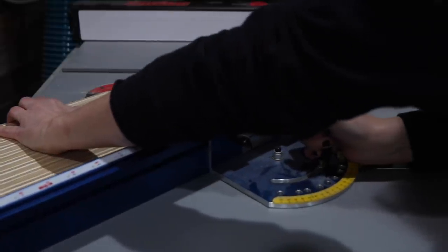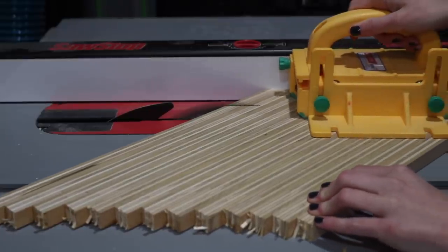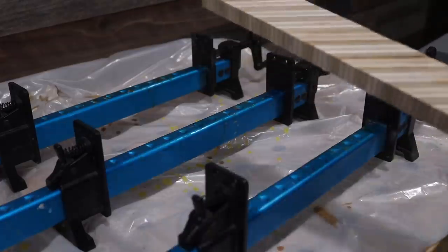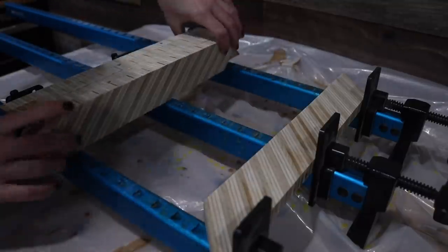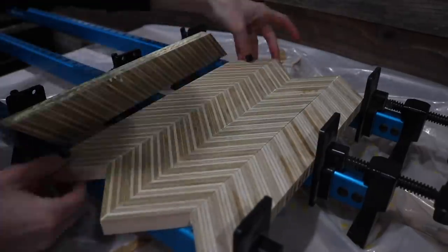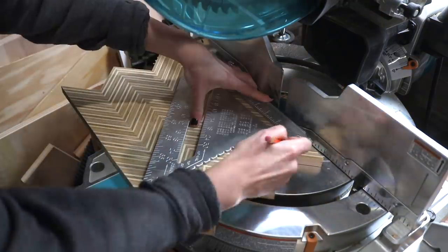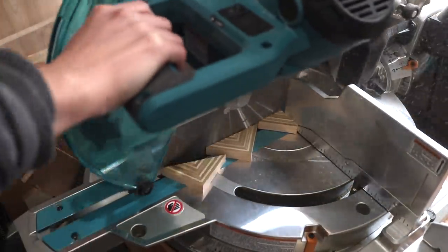Something I did differently the second time was that I decided I wanted my diamond patterns to be larger, so I cut all of my strips at two inch increments instead of one inch increments. I also made sure to keep them in order from the get-go so that I didn't mess up anything in the glue-up. I then made a really conscious effort during the glue-up in round two to make sure that the pattern lined up perfectly. Otherwise the rest of the process was exactly the same — I glued everything up, clamped it, left it overnight, brought it to the planer, and then the next day carefully found square and cut off that rough edge using the miter saw before bringing it over to the table saw.